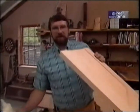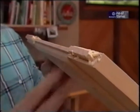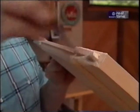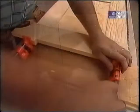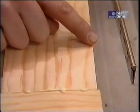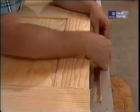This is going together quite well — everything's fitting fine. When we glue this up, we just put glue on the styles and rails on the tenons. We don't want glue on the panels or in the grooves for the panels, because the expansion and contraction of the panel might cause it to split — it just floats in the frame itself. I've also ripped the rear top style on the table saw to reduce its width by about an eighth of an inch, which gives me a little recess for the piano hinge to sit in and allows the top to close nice and flat.